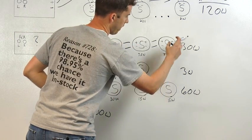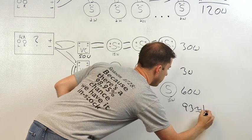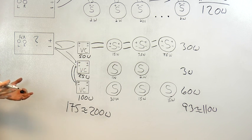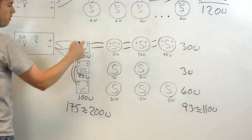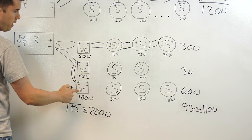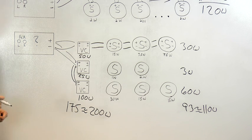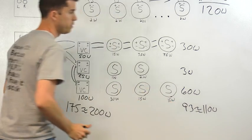Or, in the case of adding up all the speaker wattage, we have 33 plus 60 is 93, so approximately a 110-watt amplifier for your speakers. That's a really big difference — 200 versus 110 — and it depends on if you need scalability. We have 30 watts of speakers for this volume control, so there's 20 watts available there, 22 watts available for zone 2, and 40 watts for zone 3. If you plan for scalability, you're going to want to go with a 200-watt amplifier or greater. If, however, you simply design a fixed system and you're not going to add any more speakers, then you can go with a smaller amplifier.